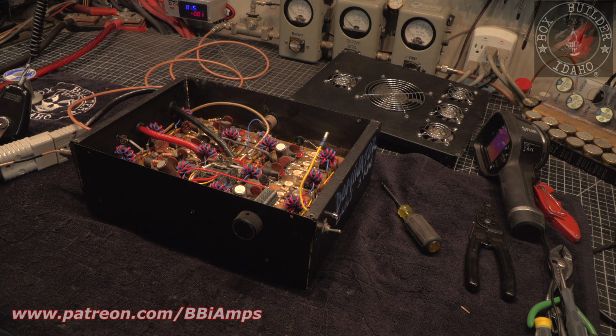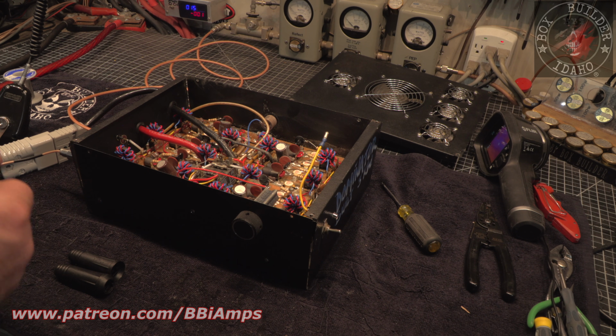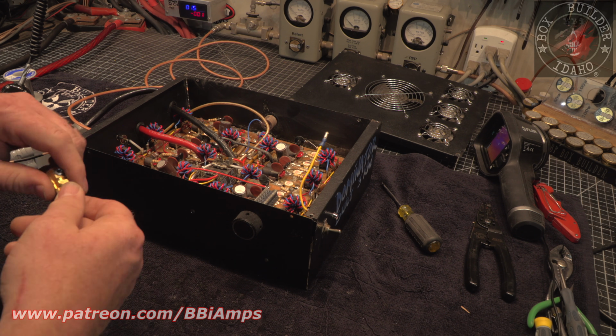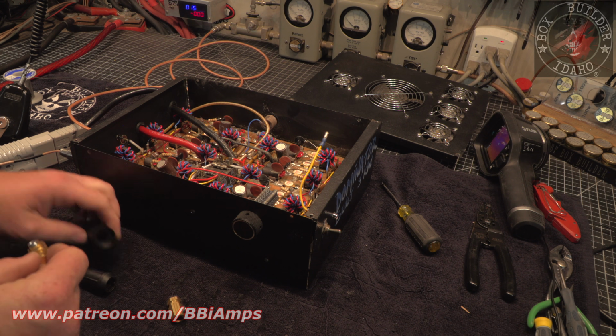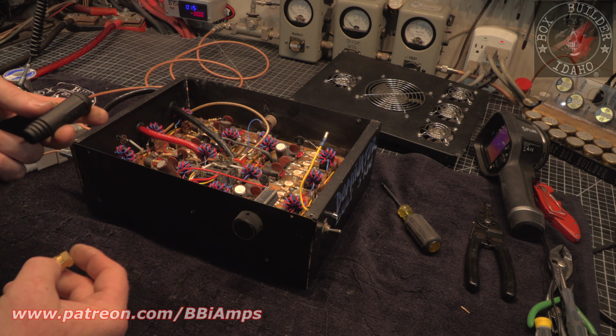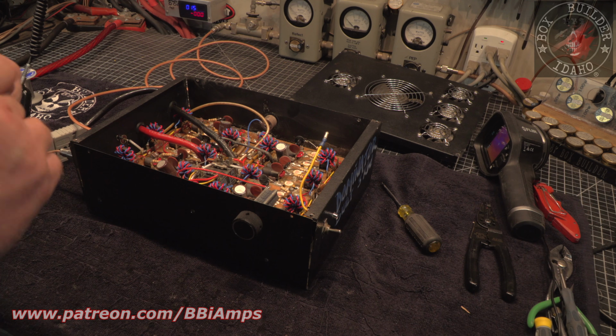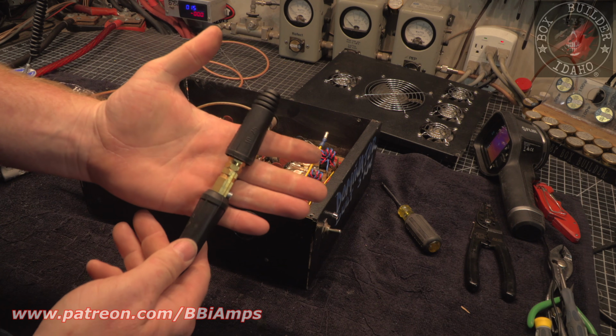And I'm with you. It's the same gentleman that sent me these beautiful things. I've never seen these before. These things are cute. I love connectors. Anybody that knows me knows I love connectors. These are not 100 amp Anderson clips, pardon me, these are welding twist lock lugs. Now you've got penetration. I've got to do a video on these. I freaking love these. You have a male and a female, of course, and this goes in there. You take your 4 gauge or whatever and run it through this. I guess this would handle up to 1-aught, but these are only rated for 100 amps. So you have a male and a female, and they go together. Little things. Isn't that cute?